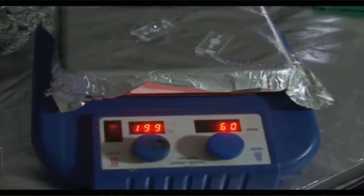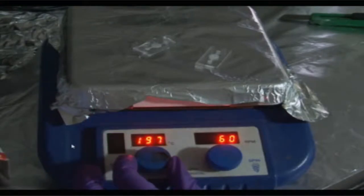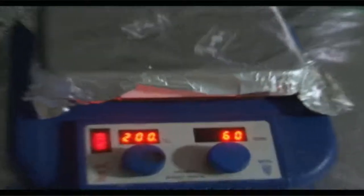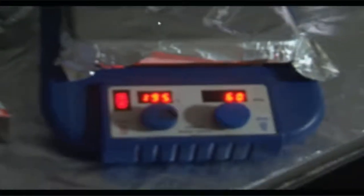The first thing we have to do is heat this PDMS using a hot plate to a temperature of close to 200 degrees Celsius, where it becomes glassy. Otherwise it is very porous on the surface, and we want it to become glassy so that this mold, which is used for the next step of micro replication by double inversion, can be separated very fast from the surface it replicates. So we set the temperature to close to 200 to 202 degrees Celsius and allow it to heat cure the PDMS for close to tens of minutes, so that the PDMS achieves a glass like structure on the top. So now you not only have a ridge like structure on the PDMS, but you are making it very glassy, so that you can replicate that glassy structure onto another layer of PDMS.